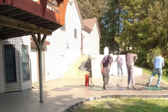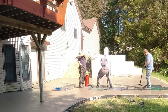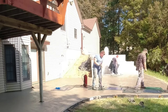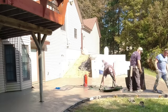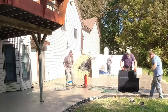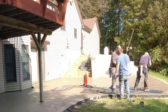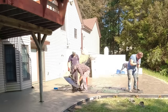The trick is just going around stuff - going up against the house slows you down a little bit, going around posts slows you down a little bit. Working your way off the edge isn't too bad especially when the forms are set nice and flush with grade. You can see how nice those black PolyMeta forms make that curve in that concrete. We basically could have made that curve look like just about anything using those forms. When you pin them in place they're nice and rigid so they don't bow back and forth like using PVC forms might - you'd have to put twice as many stakes with something like that.